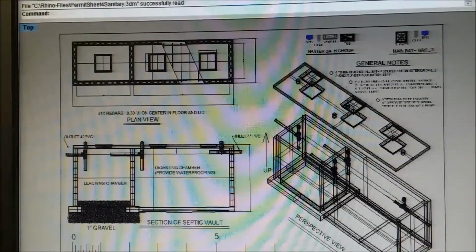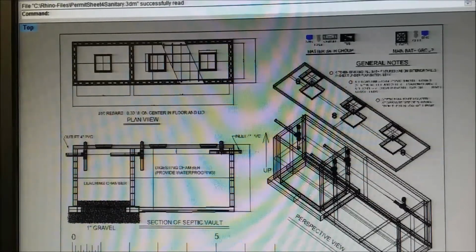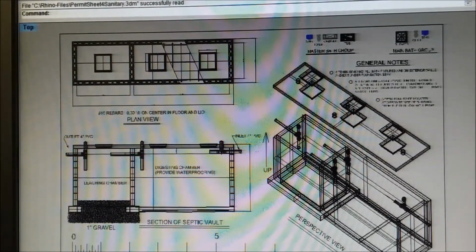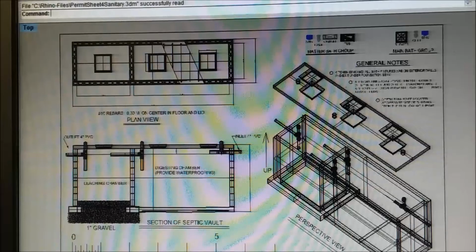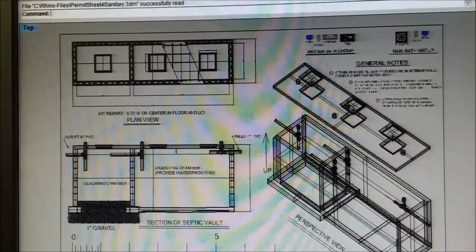You basically have hydraulic pressure, the weight of the water trying to push it into the leach field. If you had a flat tank that was total 39 inches, a meter deep, then there's no real water pressure once you've got 9 inches of airspace. There's nothing pushing it into the gravel.